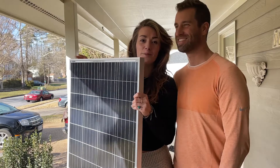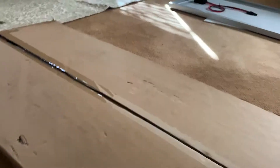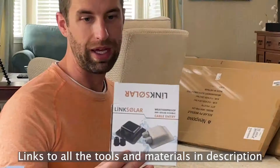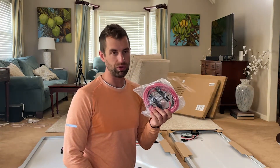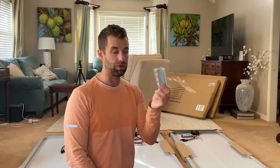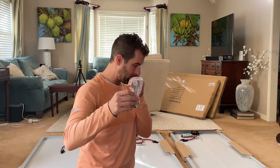I'm gonna show you how we wire everything and mount it to the roof. Going to our parts list today: we've got a cable entry gland — this will keep the wires insulated from outside of the van to inside and keep everything waterproof. There are the MC4 extension cables to go from solar panel to the battery charger; they already have MC4 connectors. These are Windy Nation — we'll put links to everything down in the description. We have these brackets called z-clamps to attach everything to the roof.